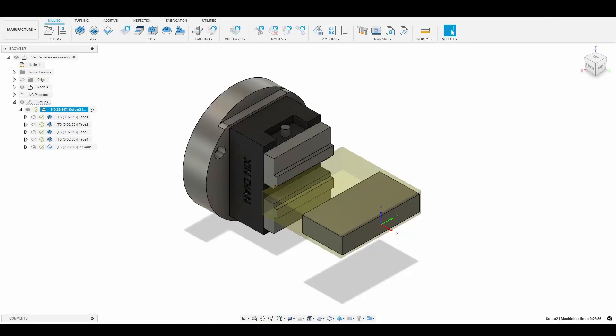Welcome back to Smith Coding and Design. This week we're going to do things a little differently. I'm waiting on tooling to start the next tutorial series, so instead we're going to go through how I set up the fourth axis on the Tormach and how I wrap my head around understanding fourth axis machining with the Micro Arc. There were a few struggles I went through and I couldn't find a lot of reference material or tutorials, especially when machining rectangular stock rather than round stock.